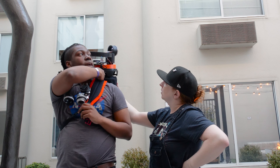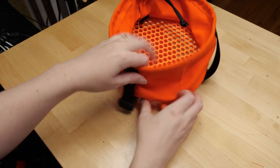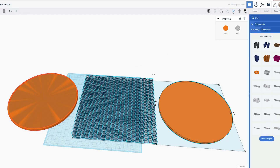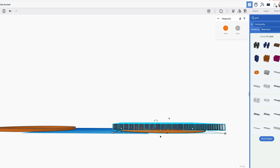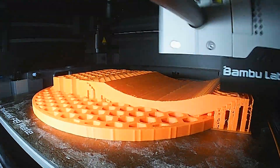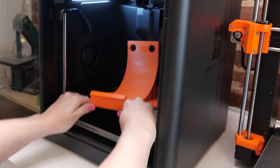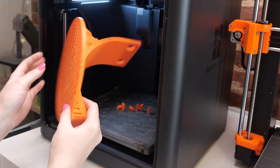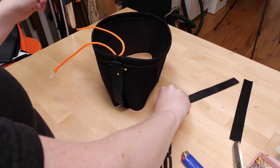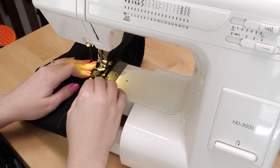After the initial prototype test fit, we decided the bot needed to sit further forward on the shoulder than in this initial design, so the bot compartment became a separate piece. I 3D modeled a flat platform for the bot to sit on and to be affixed to with zip ties, using PETG filament, which is a little less brittle than PLA. The fabric top of the robot compartment remains the same as before, but I needed to do its machine stitching before attaching it to the rigid base.